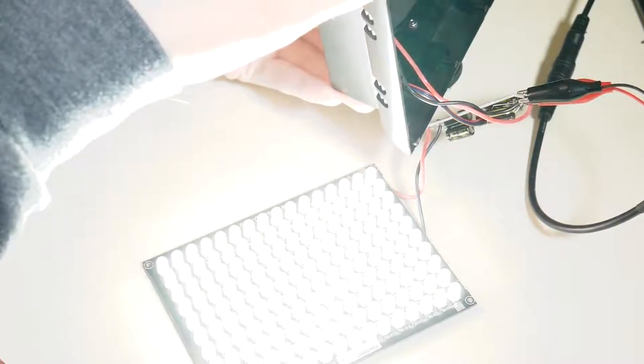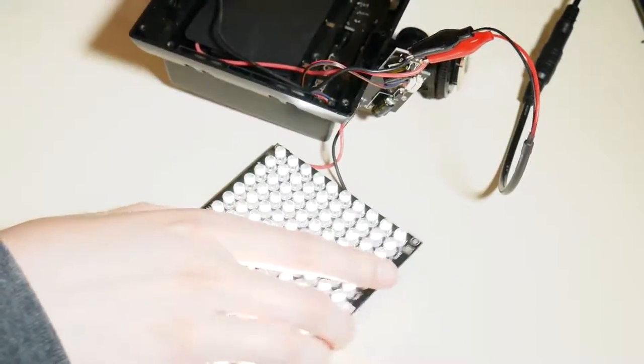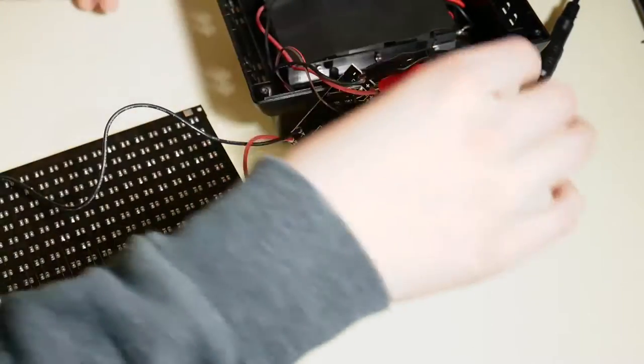And that means I am going to move forward in converting these lights to run on DC power. Now, how am I going to do that? Well, I'm going to have to break open that plastic housing a little bit at the back. I think that's probably going to be the only way to do it. I am going to want to take the battery clips out, and it looks like they just flop out. And then I'm probably going to end up doing a small PCB where I just solder in a barrel jack and some wires, and then solder those wires out the back to the circuit board that lives inside the lights that brings power to the actual LEDs.